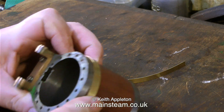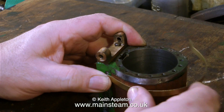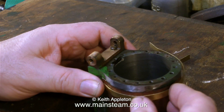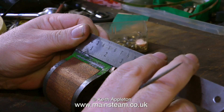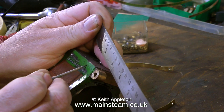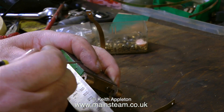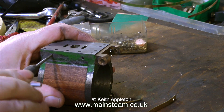In this clip I'm showing that I have already cut two pieces of brass banding and I'm seeing whether they fit around the cylinder. The brass banding will need bending strategically to fit around the cylinder, and because the mahogany cladding is stuck to an uneven cast iron cylinder, one side of the external diameter may be slightly less than the other. So it's a good idea to play with the brass banding to make sure the pieces are the right length for their position on the cylinder. Then it's time to use the ruler and start marking out — I'm scribing a line half an inch in from each end. I'm going to drill holes here and tap them 6BA, so it's very important that none of these holes break into the existing stud holes.